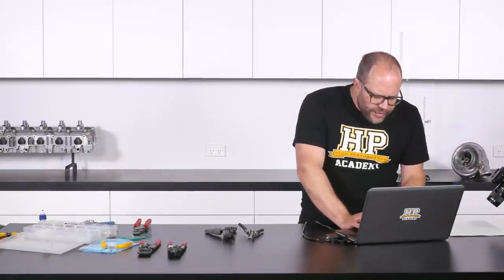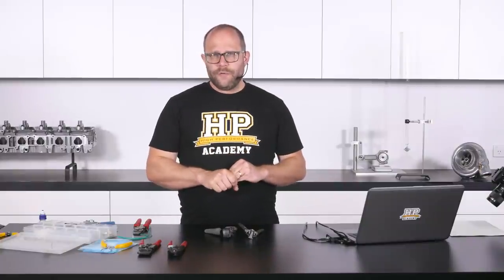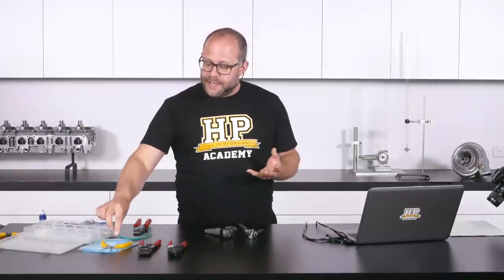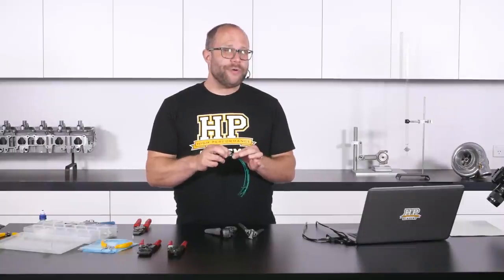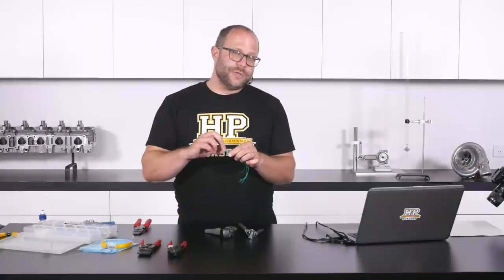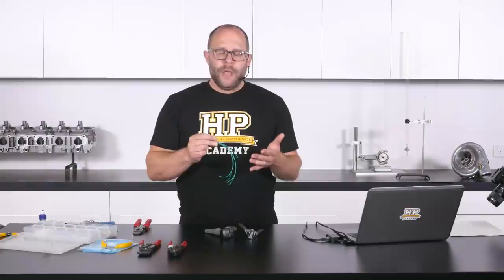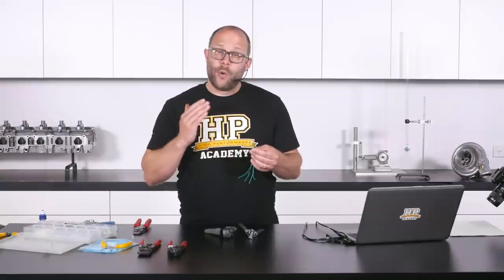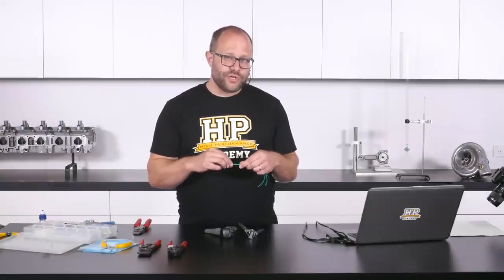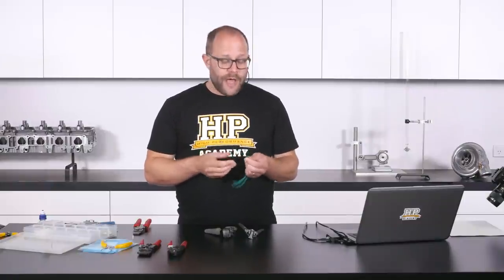Jalal has asked whether you need to worry about any sort of voltage drop at the splice. I'm going to say no — because we have put the splice join under so much pressure and those copper conductor strands are all essentially cold welded together, you can think of that as being one continuous piece of wire now. If you wanted, you could measure the voltage drop across there, but I would suspect you're going to need a very accurate voltmeter or a way of pumping quite a lot of current through that wire to get a measurable voltage drop. Performing splice joins like this I've found to be completely reliable in terms of electrical performance.